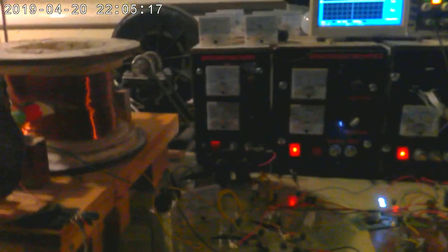Now, if we have a look at the power, it is using about 4 milliamps, maybe 3 milliamps at 200 volts. So we're well under 1 watt at the moment. However, because I've taken all that wire off, what I've managed to prove is that by loading the motor down, I get less power. It's really quite easy to load down.